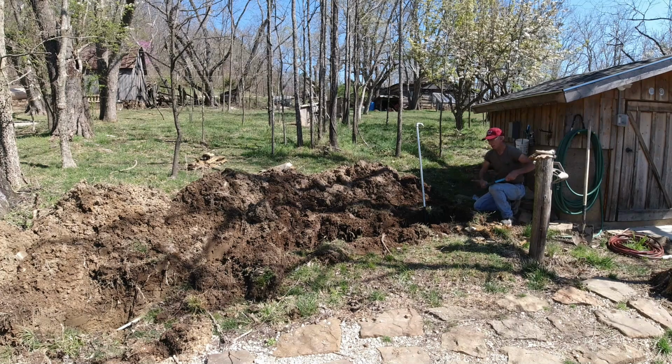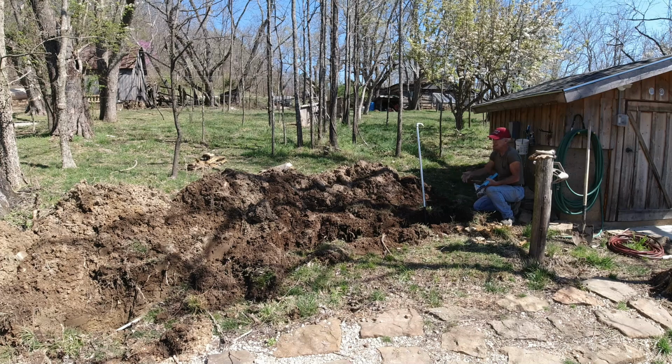Okay, my next step then would be, first of all, to go get my irrigation boots on, because there's obviously water running in this ditch. And with plastic pipe, really almost any kind of pipe, but plastic in particular, since it's so light, instead of laying in the bottom of the ditch, it's going to lay at the top of the water when I backfill it. So what I need to do is grab a shovel, get in the ditch, get myself muddy, jiggle that into the mud just as much as possible, and then backfill over the top of it so it doesn't float out. And I need to do that probably for about the first 6 or 8 inches maybe, and then I can get the tractor in here and push the rest in.